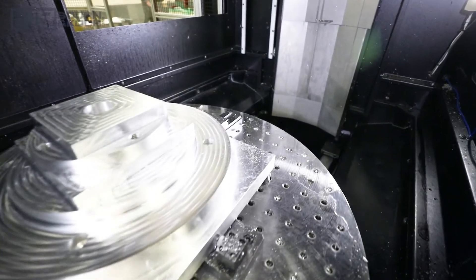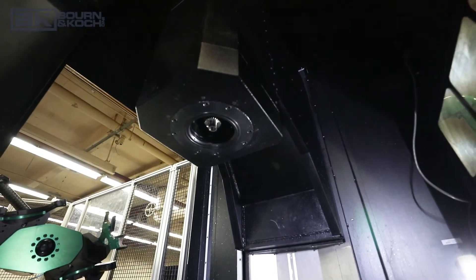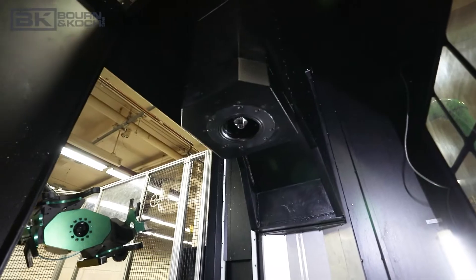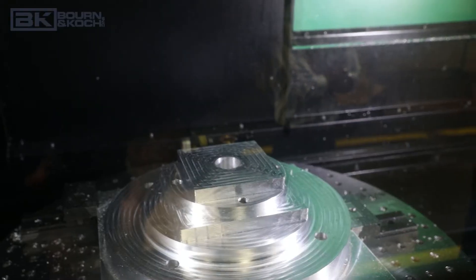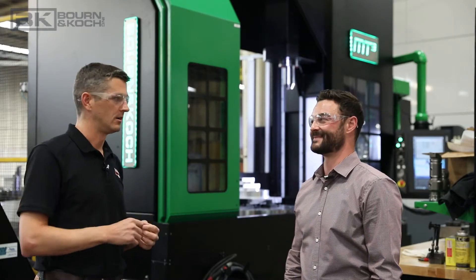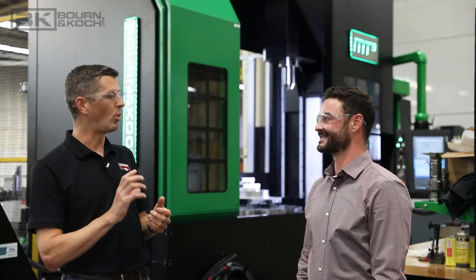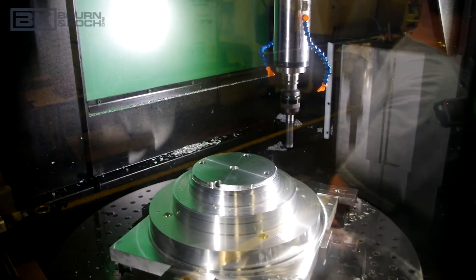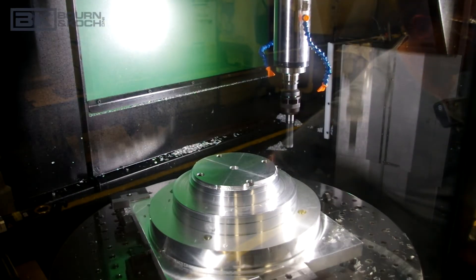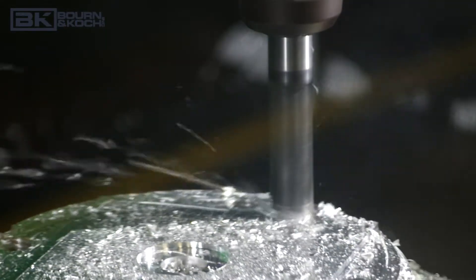So your tool changer has a tool changer? Our tool changer has a tool changer. That's what the robot is used for — it mounts up that spindle to a FANUC spindle motor that has 30 kilowatts of power and 13,000 RPM. Because you have a circle diamond square test up on there, which was done as milling — no grinding yet, just milling. But that is milled and turned — so that was turned and milled in the machine. And milling is polar interpolation? It is — using a virtual Y axis with the C axis and X axis of the machine to generate those types of cuts.